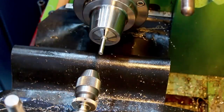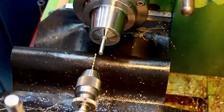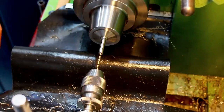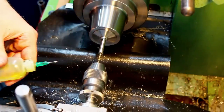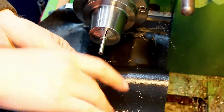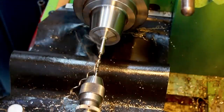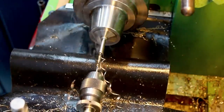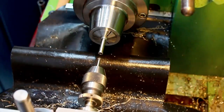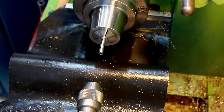Drill chuck for drilling, obviously. We have a 2.5 millimeter pre-drill because I don't want to force the 4.2 millimeter drill into solid 316 stainless. 4.2 millimeter tap drill. A little bit of a countersink for the tap to start. And an M5 tap,